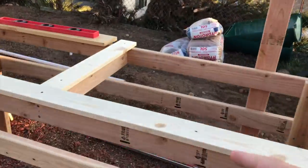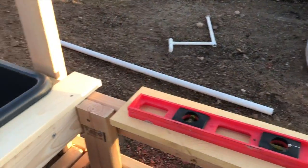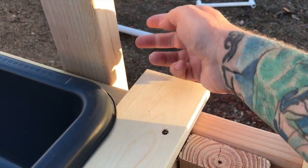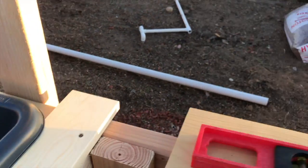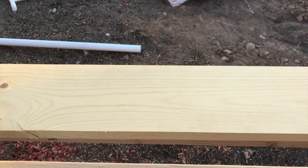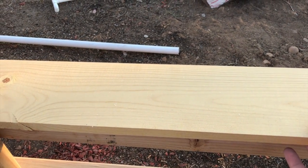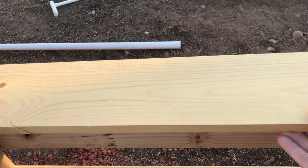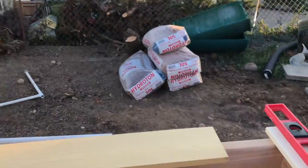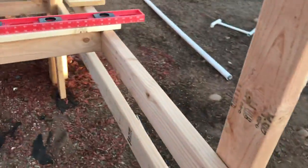Anyway, back over here. So I got the third section done. I went ahead and put trim boards all on this side and in between. You can see it sticking out a little bit here. That's if on the other side, if my calculations are right, it's the same distance. Well, my calculations aren't right because that's not right down the middle, but they'll meet. And then I'll get a couple more pieces of this 5.5 by 1. It's actually called 6 by 1, but it's actually 5.5 by 3/4, and it will go right about there, a little bit more over, and that'll be enough to gap between the 2 rows. So that's why you don't see anything down there yet. And I might even jigsaw it so it fits right around these uprights.